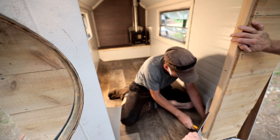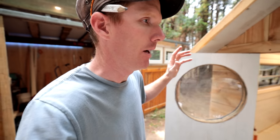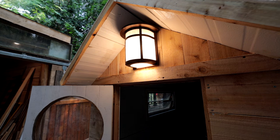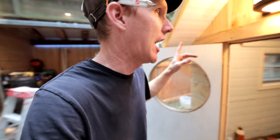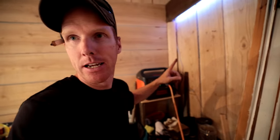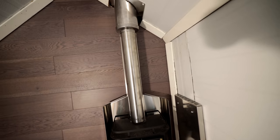I say we don't even glue that thing down — we put baseboard down and that's going to hold it in place. My original plan was to silicone all the way around the perimeter. We need outlet power and to figure out where everything goes. We've got some LED panel lights I'm going to fix up in the ceiling — thinking of a piece of wood and recessing it in the ceiling. We've got the interior lighting done and that's all plugged into my Jackery. The Jackery is currently being housed in my shop with an extension cord. We're at 81% for the entire build so far. The whole shop is running on the Jackery — drawing 61 watts AC. Got my accent lighting in the shop, and that's powering the entire inside of the cabin.